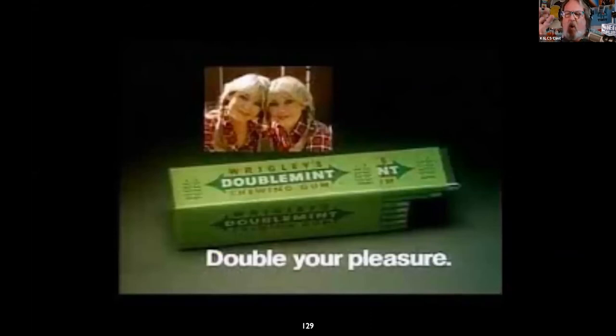Anybody have an FT-70 or any radio they wish they'd get longer life out of the battery? Here's how you can double the life of your existing battery: buy that Smiley antenna or the Diamond 17-inch flexible whip. Get a nice aftermarket quality antenna and turn your transmit power down to 2 watts. If you're not making it FM voice line of sight with 2 watts, you're not going to make it at 4 or 5. There — I just doubled your battery life.